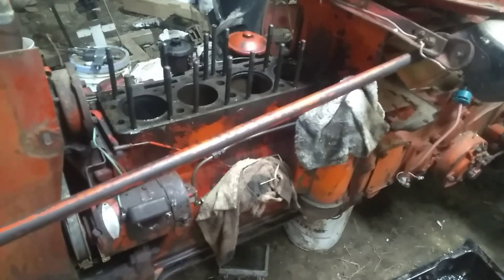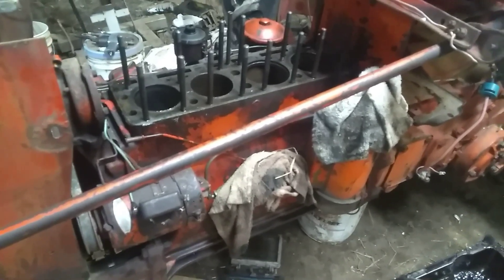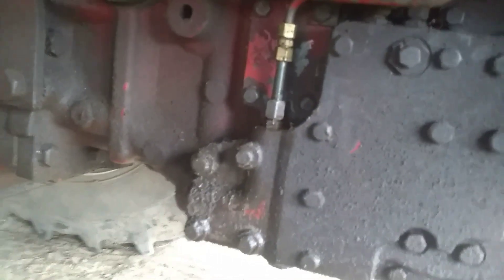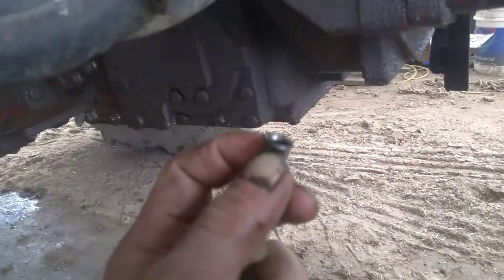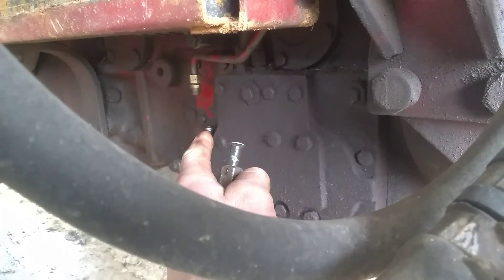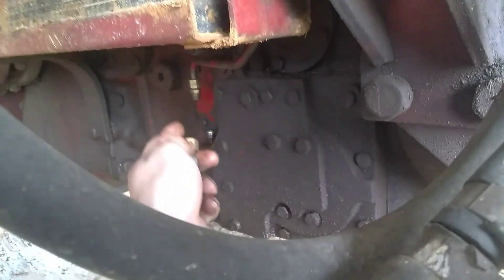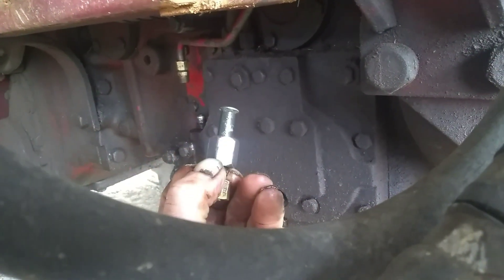Anyway, I've got to try to fix a leak on my hydro. This line here is leaking out of this fitting. I'll pull that off and see what we got going on. Well, from what I can tell, this flare is a little wonky. What I'm gonna attempt to do is wrap the backside of this flare with Teflon tape and put a little Teflon tape on that fitting, see if we can stop her up. I think this is something somebody cobbled together to fix a leak — they've got a couple compression fittings here, and then this piece they must have flared out with a tool.